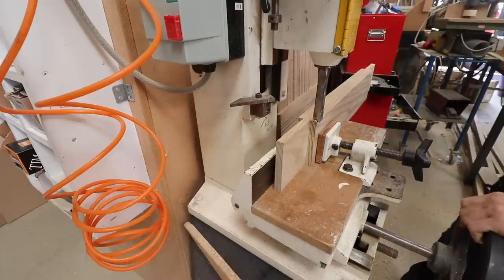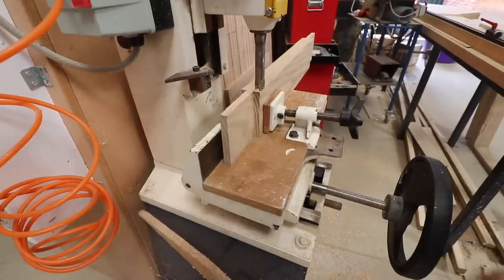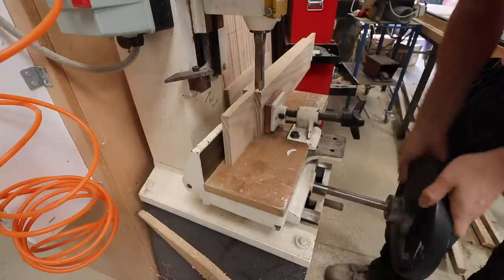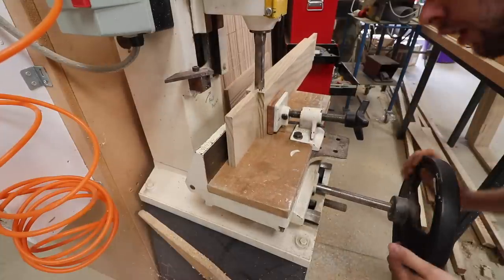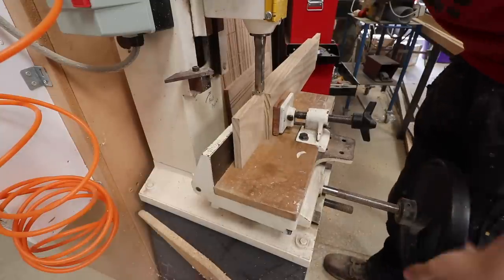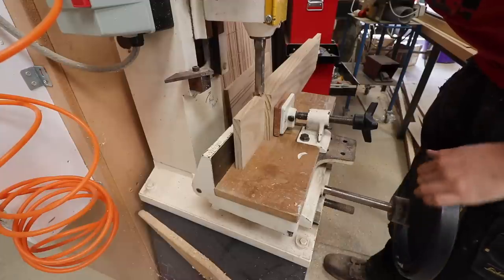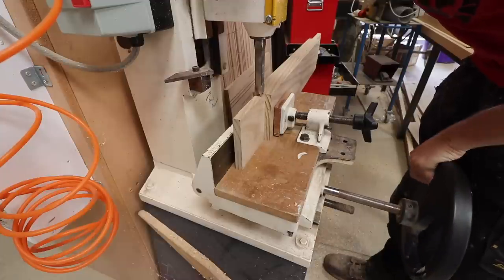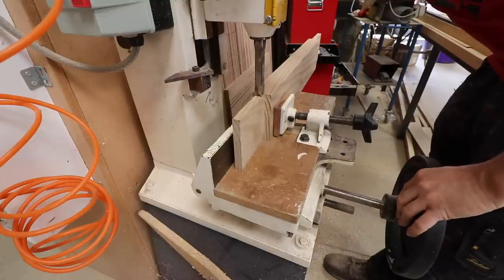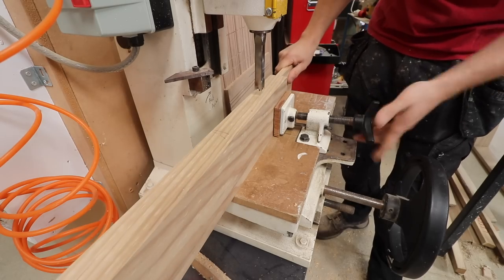We'll just set the position of the mortise chisel on the Sedgwick machine. You pull this handle outwards and it engages in the cog that adjusts the forwards and back position. So it's one handle that does both movements. It's quite low geared, which is nice. You can get a really accurate tenon position. This way, you're pretty much guaranteed to get a nice flush joint, or as close to it as you're gonna possibly get if you do your mortising first.